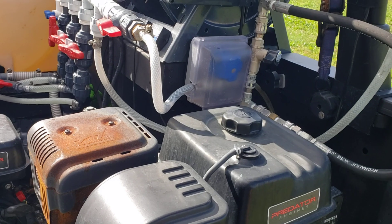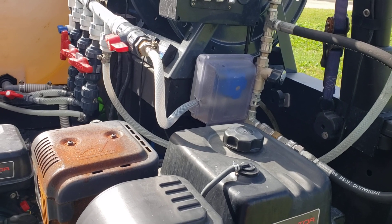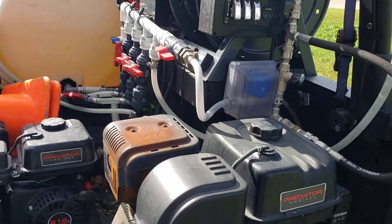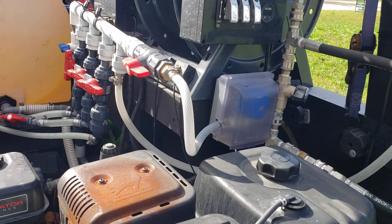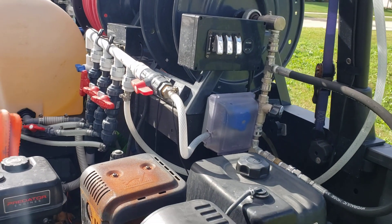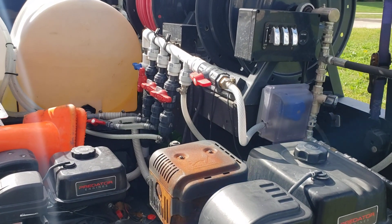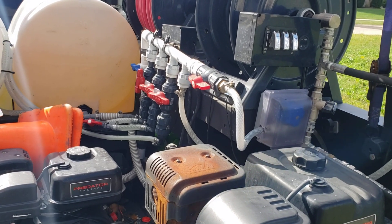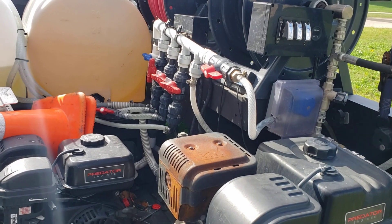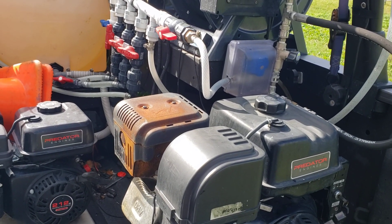It's not really that expensive for all the components involved. Even counting the enclosures, the LED button, the strobe, fittings, and everything — delivered with tax — you're probably less than $150, and you're in business. One important tip: do not put your electronics and your automatic ball valve in the same enclosure. I see a lot of people and units sold that way, and I don't think it's a good idea — even a slight leak will chew up your electronics and you'll have an expensive fix. I just don't want the headache of downtime and a piece of equipment failing on me.